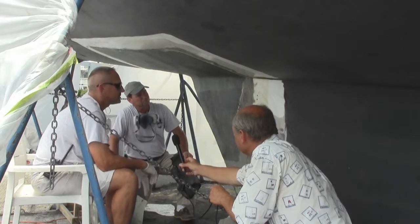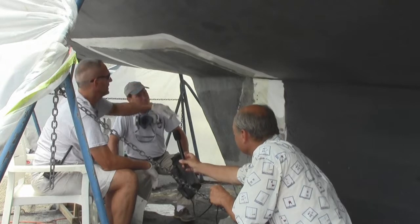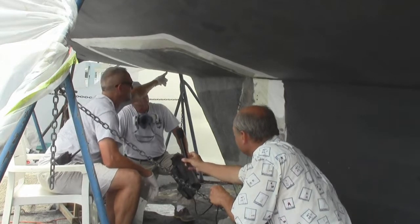Because of the size of the mast in this boat, it's supported by a grid system and the grid system wasn't fastened in very well. And that allowed flex, which cracked right here.